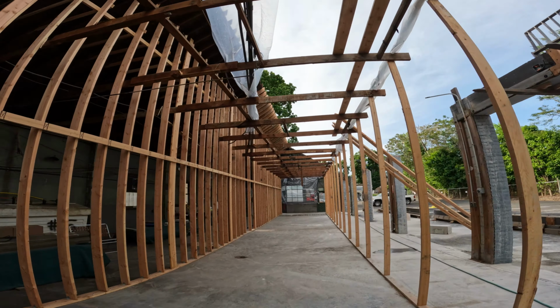Now, originally we were supposed to put packing in on the top, this little detail here. My engineer put a piece of packing on two in the webbing and one on top. Now, we need one on the bottom, which isn't necessarily shown in this cross-section view because they're gonna stop before those metal posts and they're just gonna start back up right after the metal posts. So, I don't know if he intended to have packing on the bottom, but we need it for a nailer for the fascias. And I don't think I'm gonna do these inside ones because I don't think we need them, unless my garage door guys say they need a nailer right there, which they very well might. I'm hoping they don't need it, so we'll see. But other than that, I think we're all caught up for now.